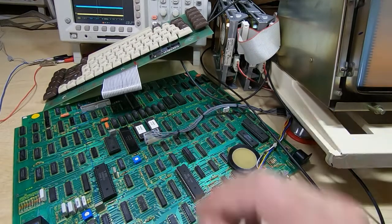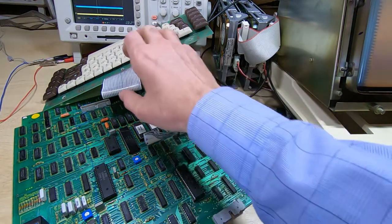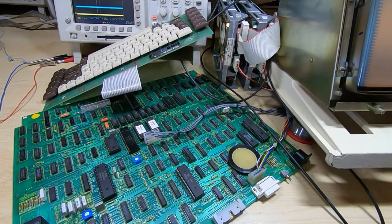So again, we know that the video RAM is working to a certain degree, because when I had the RAM chip in, it was passing this particular test. But the various things that are specified for this machine are what are causing the confusion here. The bank-switched RAM is specified as being at 0000 to EFFF, and the Fluke couldn't find it. So it does tend to indicate that the way this machine is laid out, there is some interaction between the in-out decoding and the RAM access. And it's not necessarily that surprising, but it does make fault finding without a schematic very difficult.